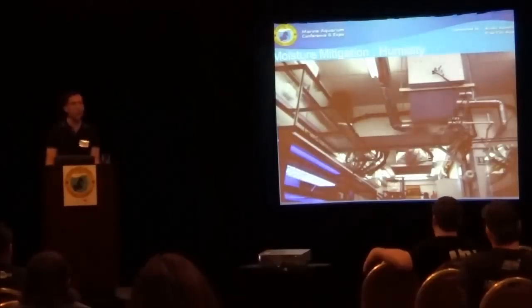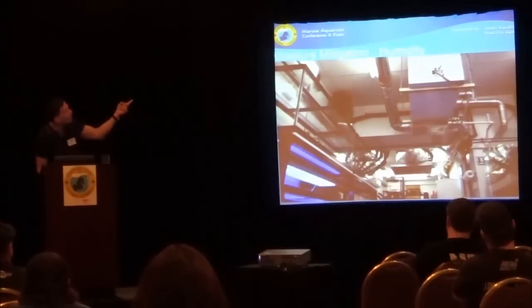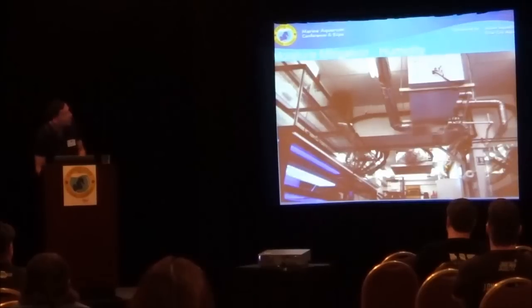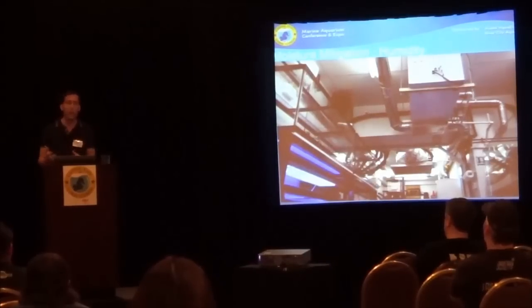So this is a shot of the ceiling in the fish room. If you look in the uppermost left corner is the HVAC for that room. Big box straight in front in the middle is the dehumidifier with ducting that shoots its output to opposite ends of the room. Big tray just past that with the silver massive looking thing is the HVAC ducting that goes up to the canopy system. And then there's another HVAC down at the end. Additionally, there's some venting that pulls outside air in when the humidity is low enough, so I'm not running these compressors without heat.